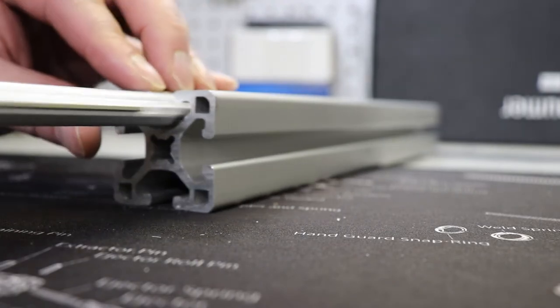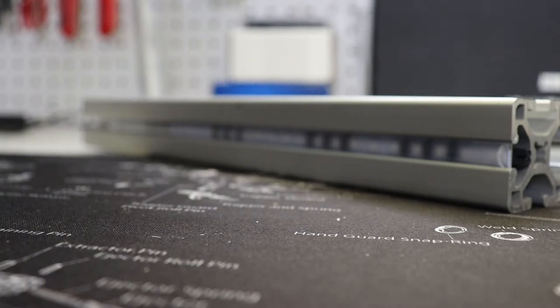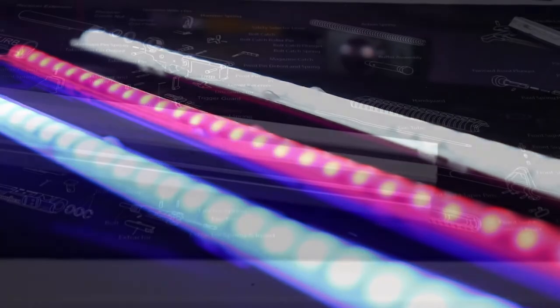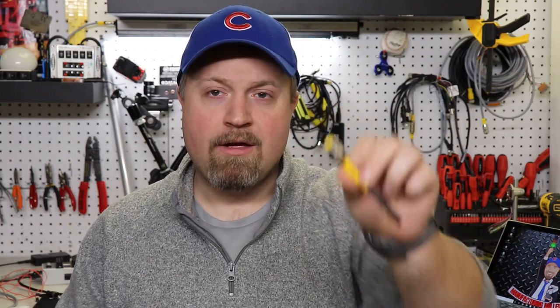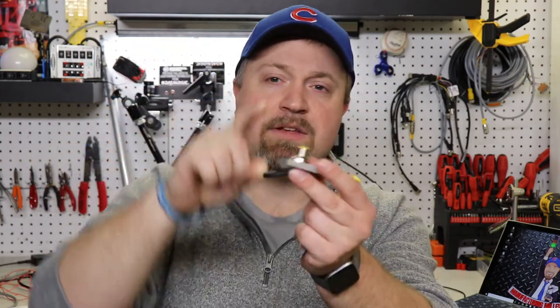With this unique profile, we can slide inside our 8020 T-slot and get cascadable unique lighting for our application. The T-slot comes in multiple wavelengths: 470 nanometers, 505, 560, 625 red, and also white. We can take up to six of these and cascade them up to 1800 millimeters in length with 300 millimeter length increments. The lights run on 24 volts DC, and there are multiple connectors provided by Smart Vision for your application — a two-pin M12 going in right here, and also options where you can bolt your power strip directly to your T-slot to power up your light.